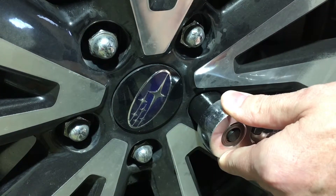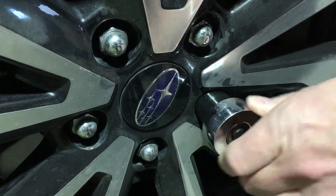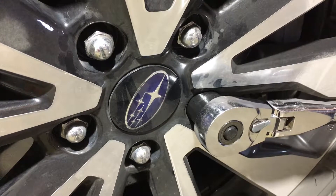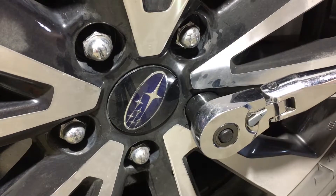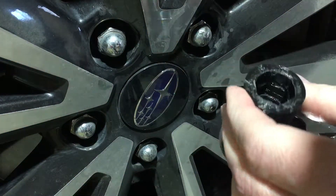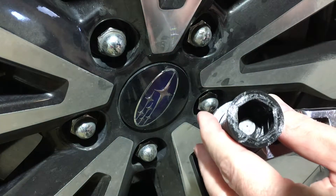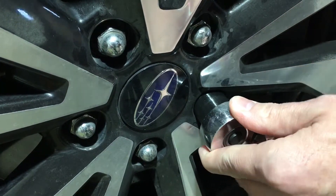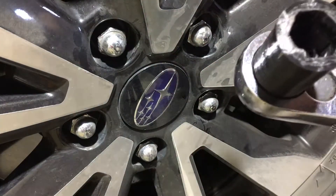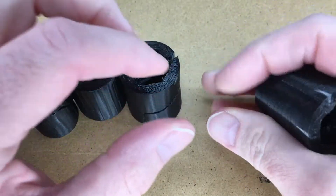Here goes. It's moving the wheel. The socket moved — I don't know if the lug nut turned inside of it. It didn't totally destroy this, which kind of surprised me, but it did look like it expanded it out. So I think I'm getting closer. I don't know if taking the infill up to 100% would make this better, so I'm going to try it one more time. Now it just expanded it out. You can see it kind of stretched this out but it didn't fracture like the previous one did. So I would definitely say it was tougher.